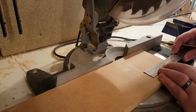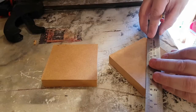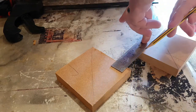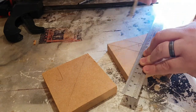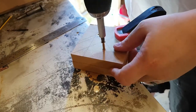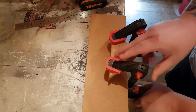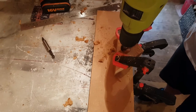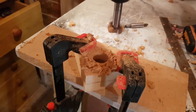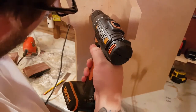I'm going to cut out two triangular pieces now to go underneath with the feet just to keep it at a right angle. I should really have a blade with more teeth in it to get a nicer cut — that's the only sharp one I have at the moment. I'm going diagonal here just to get the angle, then using a ruler to work out where I'm going to be drilling my holes. I'm screwing the two pieces together so that I can get a nice cut and they'll be the same size. I end up with two perfectly identical pieces and I'm going to attach them to the base now — I'll just drill a couple of holes first. If you didn't drill the holes you would end up splitting the MDF.